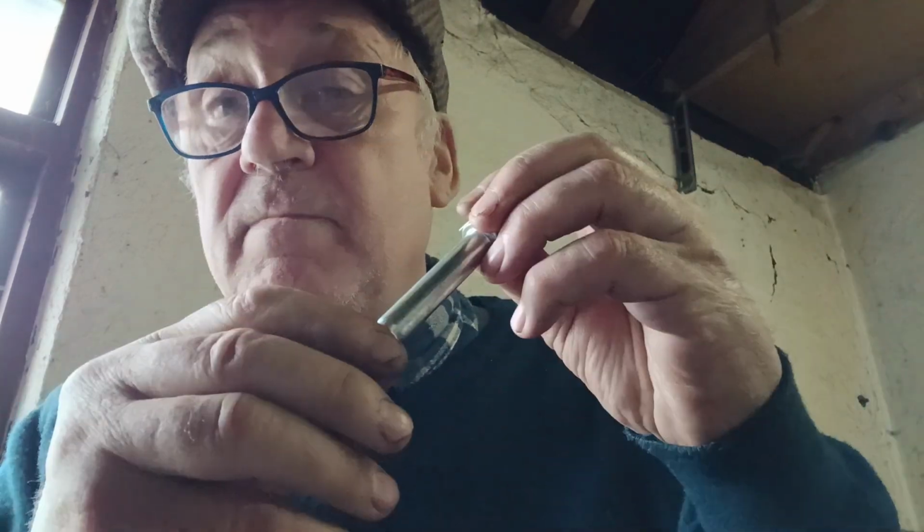One of the things I never really got to grips with is the top of a bolt. On top of a bolt, they write this 8.8 and JDF. If anyone wants to do a program on what that means, but it doesn't really matter. The leg of this bolt is made of a kind of toughened but not hardened steel. You can cut this with a hacksaw, but it's quite tough, and it's designed so that it's upset at the top. It's not milled. If you make a bolt on the lathe, it's not as strong as the one that's put together under heat. Although I have stretched these and pulled the top off some of them. Some are just pressed on, and some are actually made by heat. Enough said.